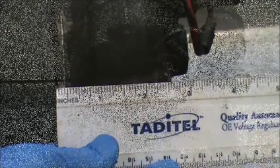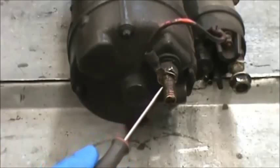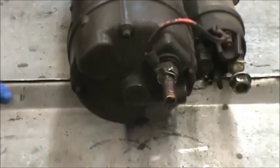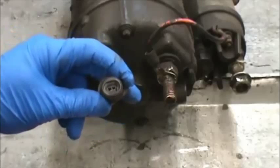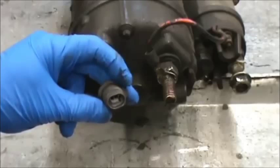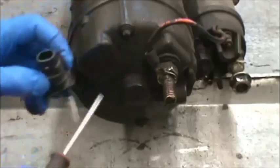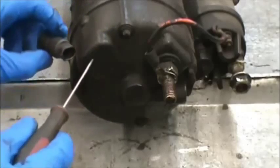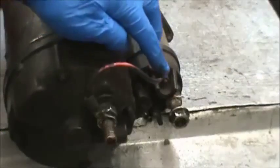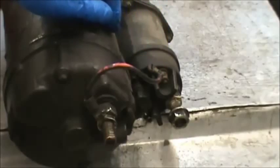On the 42MT it's going to be almost four inches. On the back of the 37MT there are different variations — some don't have the grounding bolt, they're internally grounded, and some have the thermal limit switch. This is over-crank protection so that if the starter is cranked for too long it cuts out. This is the sensor, it goes down inside, and you'll see it sticking out in this area. Also, this externally grounding wire — some units have it, some units don't.